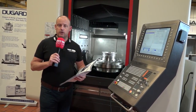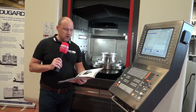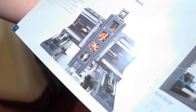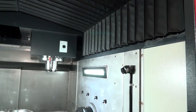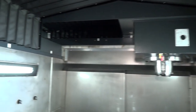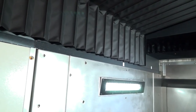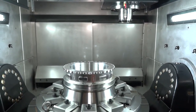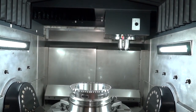The first thing would have to be the construction and how this machine is built. This is a gantry style 5-axis machine and the machine structure is key. The Y-axis has a dual driving system with four linear guideways, which means its strength and stability when moving in that axis helps when machining harder materials and removing metal, as well as for longevity. The X-axis moves left to right with the spindle, meaning you get equal rigidity throughout the machining process wherever you're working on that 5-axis table.